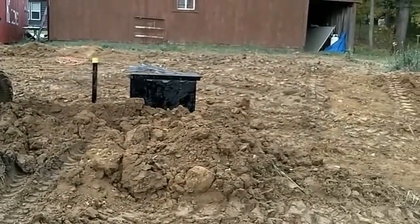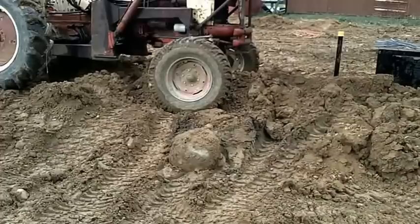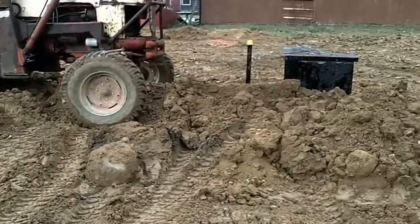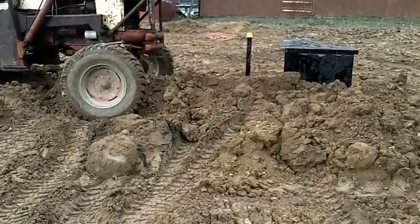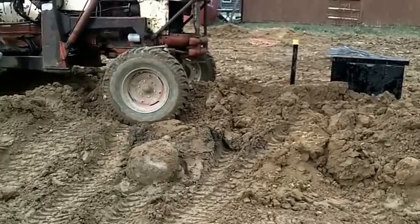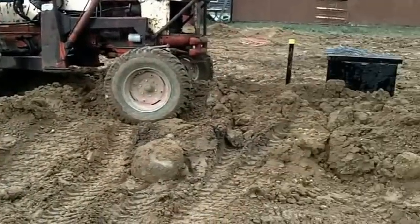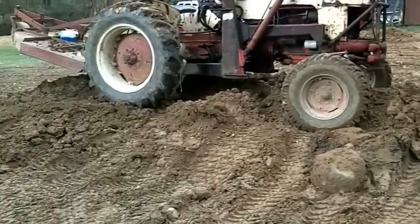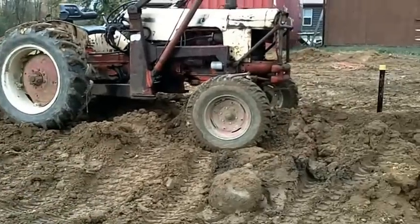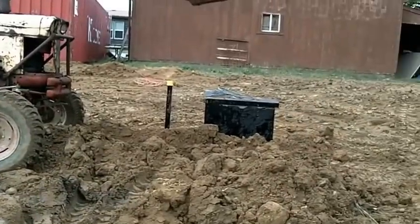I'll wait out the weather before getting equipment out to build the pond and bring more dirt. One thing I want to stress: don't spin your tires on it. When you drop dirt on top, you have that plastic and tar — don't slide it around or back-drag it. Just drop it and let it go. Don't spin your tires on it because you want that ground to set up before you start driving on it. I was careful getting up on there and everything worked out right.